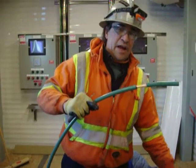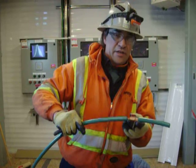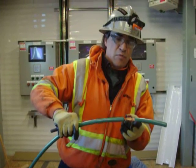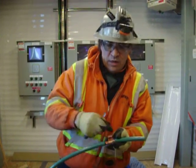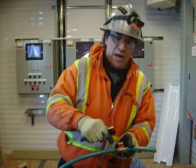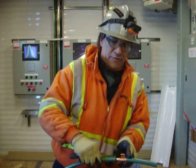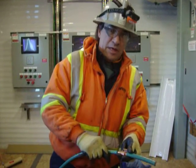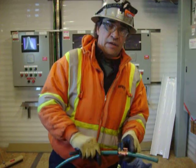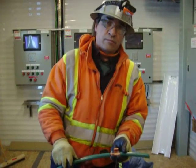The reason I've cut it that wide is because once you get it inside the C-tap, you've got to get a second wire in there, and if you don't have enough movement in there it won't go in that easy, making it very difficult. Also, the high press tool is wide as well. You've got to make sure you give enough room for the tool, being able to get both cables in here, and the fact that the C-tap itself has got to be fitted as well. Thanks.